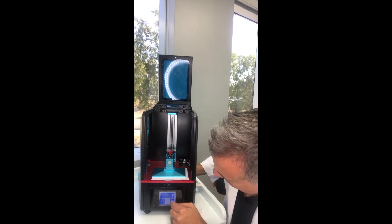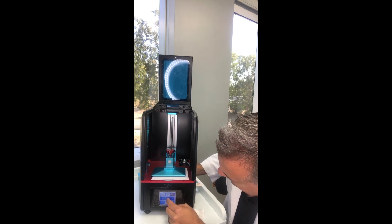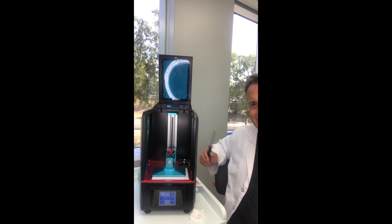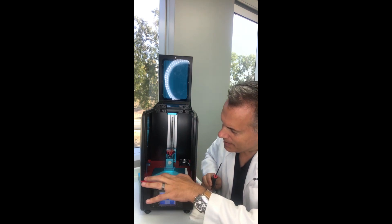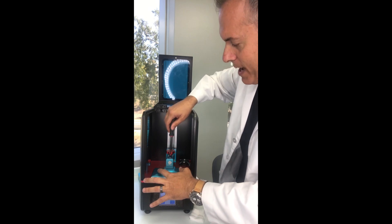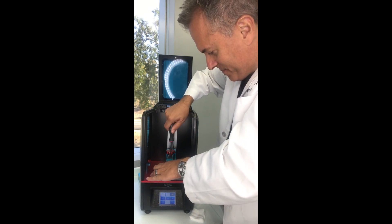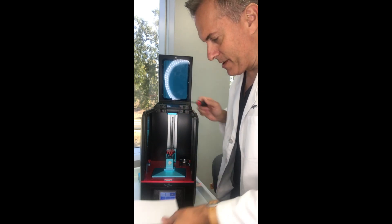At this point my paper is pretty snug. Now we want to make sure this is tight, and then we are going to set this as our Z zero — hit yes. Now if we go to Z axis and move this up a little bit and then hit home, sometimes when you set the Z axis it kind of goes up a little bit. In this case things worked out pretty good. I'm going to loosen the bolt and push it down really hard so that my paper is nice and snug underneath it.